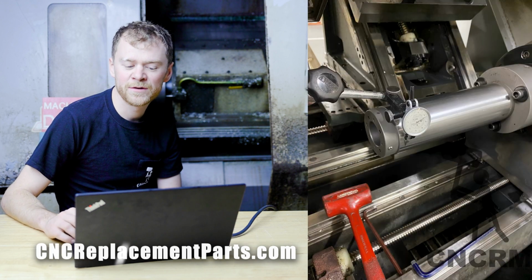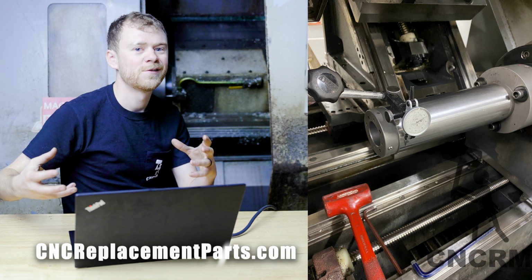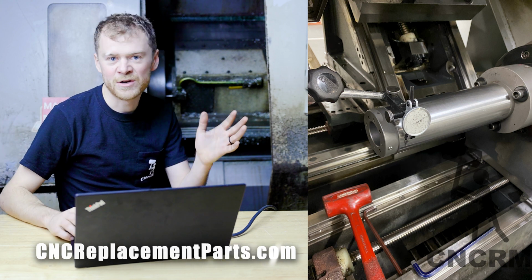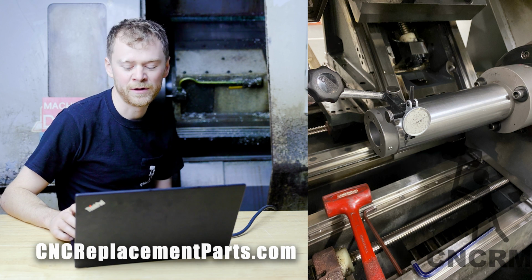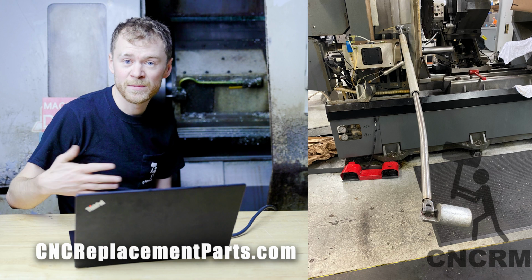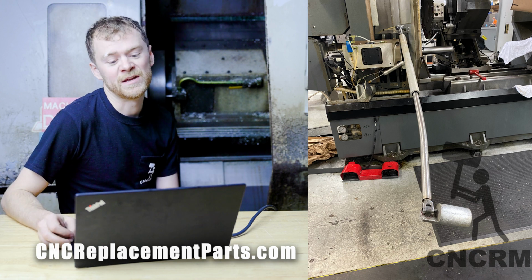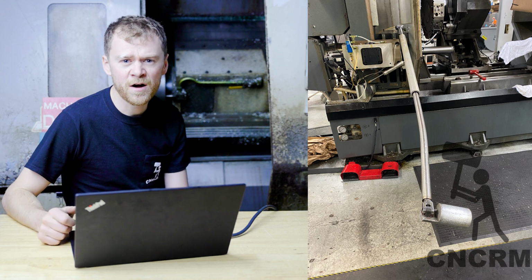Checking now the sub spindle, I wanted to see, is it crooked, is it high, is it low? And I didn't really care about on center because I knew I was going to have to move the spindle anyhow. So here's another picture of checking to be sure that the sub spindle isn't crazy. And the spindle was off to begin with. And I thought, well, I have the test bar on there.